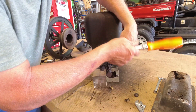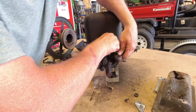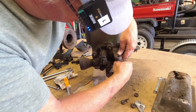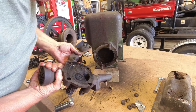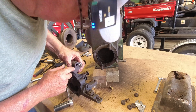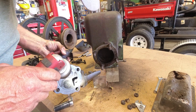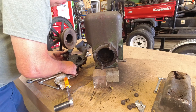There's some tomfoolery going on here at this exhaust valve spring — we may want to pick up a couple new springs. The intake spring has been around the world a couple of times it looks like. Now's the time to put new parts on it while we have it apart — put it up in good condition, make it look nice. Here's the head. Somebody's made a makeshift choke plate out of a piece of bandsaw blade or hacksaw blade. I can look in and see the points for the igniter — that needs to be cleaned up. We'll take the igniter off before we go back together with it.